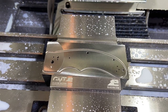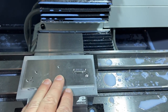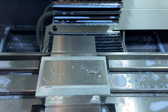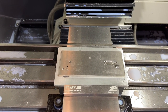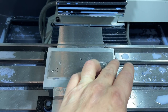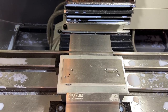This piece is profiled and beveled on the back side, finished on the front side, back on the jig. The goal is to get through this full contour program without breaking any cutters and confirm we've got our recipe dialed in. No tabs this time — we're just going to contour through and then go back with the 1/16 cutter to get rid of all the extra material around the edge.